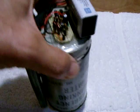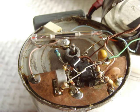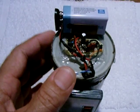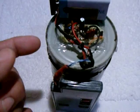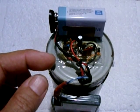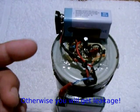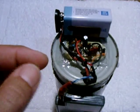You can see the circuitry in these images. There is some work involved in this build because you have to make the 50-volt board and assemble not only this circuit but the circuit underneath the cap. That circuit has a very high ohm resistor — we're talking 220 gigaohms. When dealing with high-resistance circuits like that you can't have anything touching that resistor. The insulator where the copper sense wire — just a 14-gauge wire — runs down the center of the can has a little gray insulator.